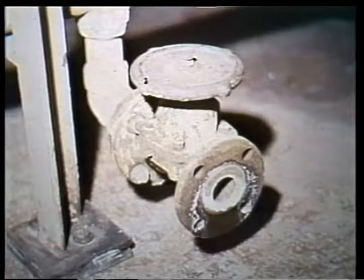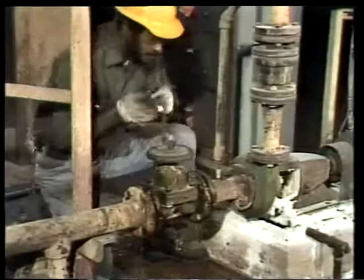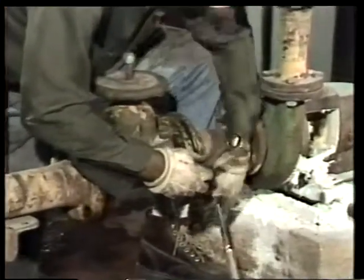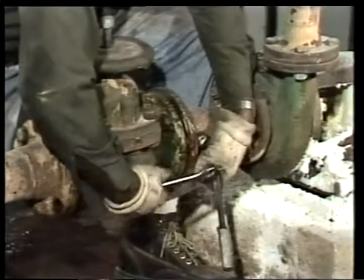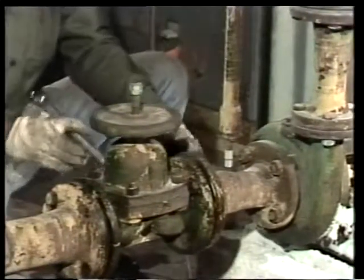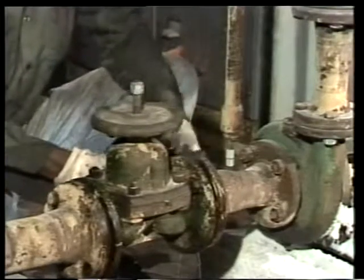This line of pipe was drained before our work release was issued. However, a small residual amount remains. The water you see dripping from the flange connection on the right is just some water that didn't drain completely. When the bolts are loose in their sockets, they can be removed. Take out all but one of them on both sides, making sure the ones that are left are on opposite sides and diagonal from each other.